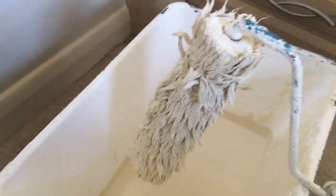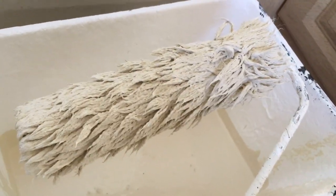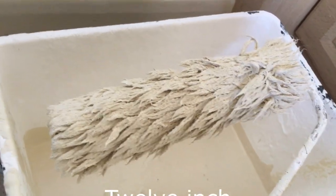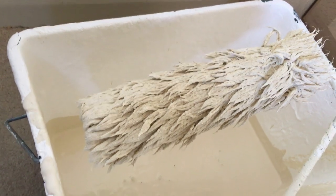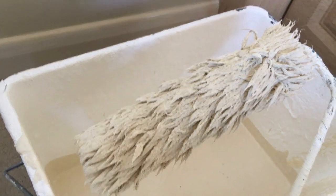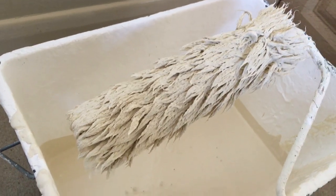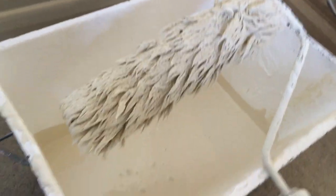My dad's been a decorator for 45 years so I've got quite a lot of tips from him over the years. I always use a sheepskin roller - just a nine inch sheepskin roller - and the coverage you get with these is just amazing. Allied with a good quality paint, in this case it's Johnstone's Cover Plus emulsion which I use all the time in white and magnolia - it's just fantastic paint. Sheepskin roller, scuttle, on a pole, and I'll show you now how quickly you can roll the walls.